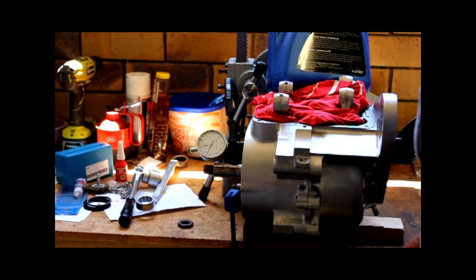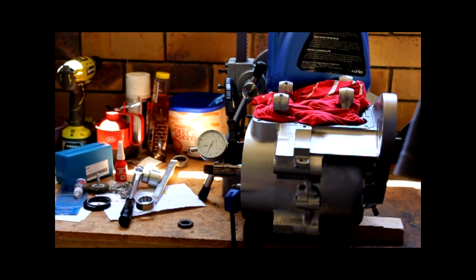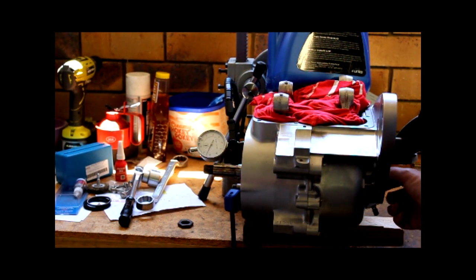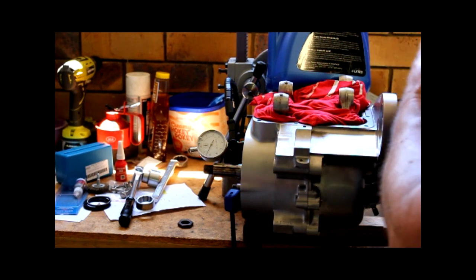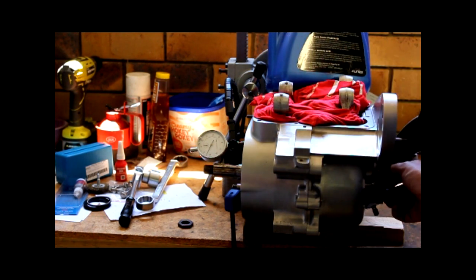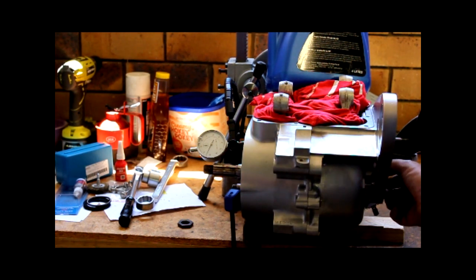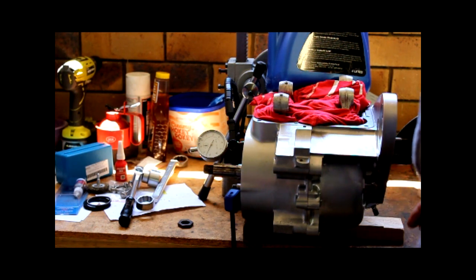And the rear one is 0.15 mil, tolerance is 0.127 to 0.1524, so the rear crank is within spec as well for end float. Swap them out, and I think I might have mentioned this earlier, the shimming is all down on the bush side, so we're pulling the crank away from the bearing. I might have a little play and see if I can get it sort of in the middle of tolerance, but certainly it's there, that'll do.